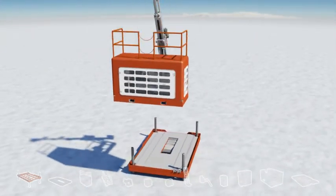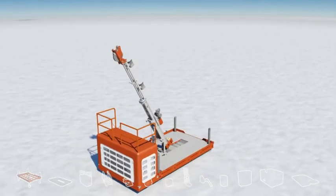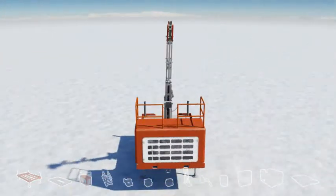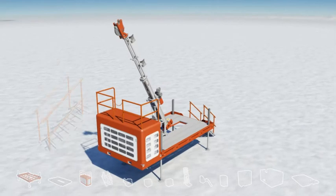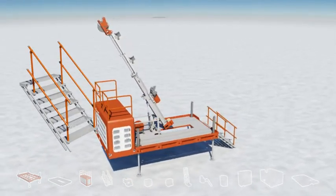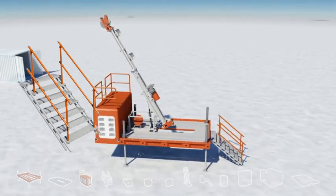The power pack and the shelf are assembled and connected using the multi-line quick couplings, accessible through the hatch opening in the wall element. The collapsible steps are mounted in a recess in the base frame and are made to be non-slip. When the steps are collapsed, the poles and handrails are stored in the space in the step frame to facilitate transportation.